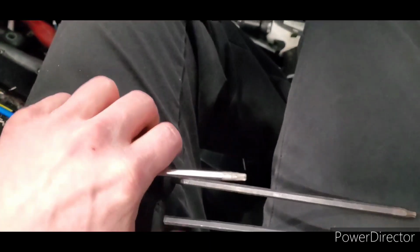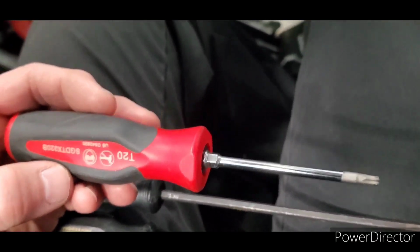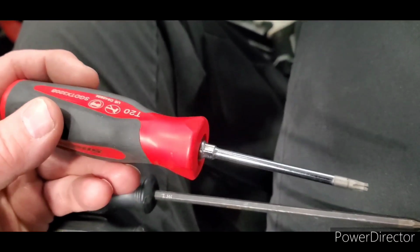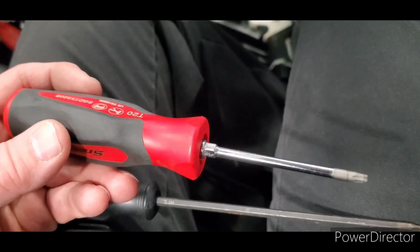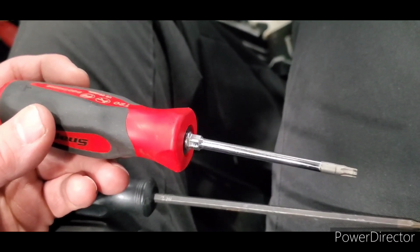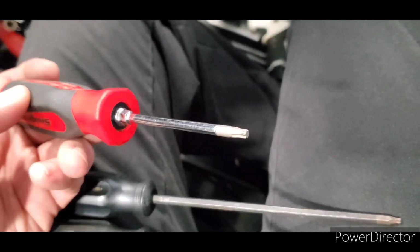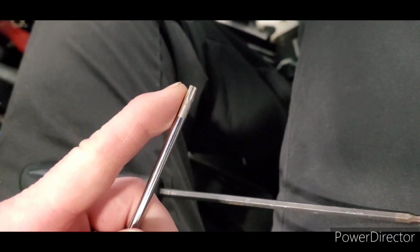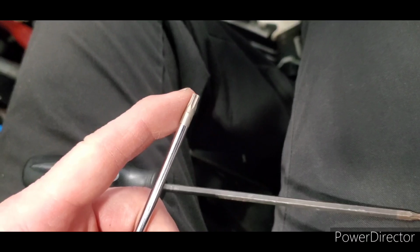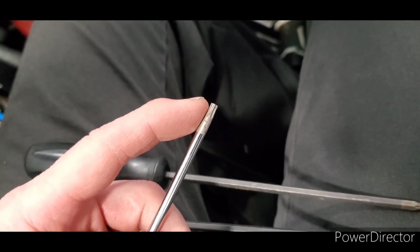But they are a Torx head, and the reason I have them, especially the 20, is I started in GA and I'm back to it again as part of the AOG job I do. We work in a hangar doing GA the rest of the time, and if you work on bug smashers and you have slick magnetos, you're going to need these to get the screws, because you can't use a bit holder because they're recessed very deep inside the casing of the magneto. But they have a Torx head screw. Sometimes there's a slot, but not always.